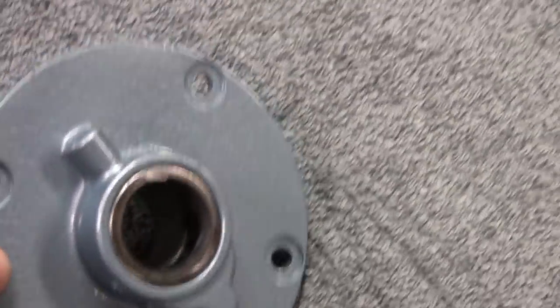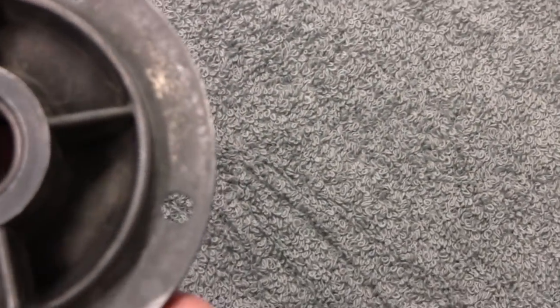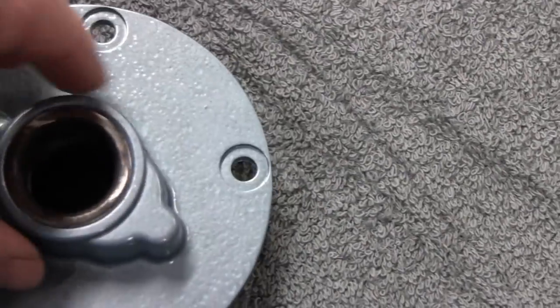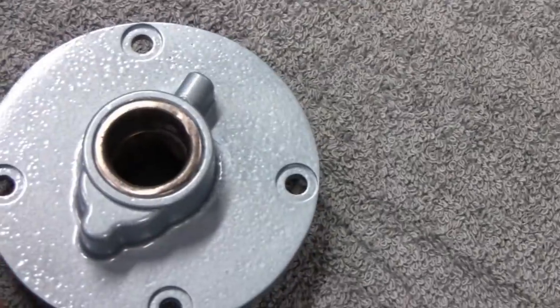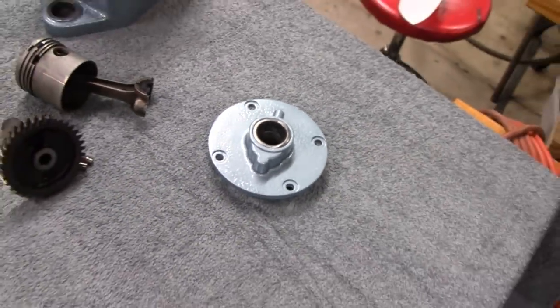You know, when I made this, a lot of guys left comments. I wouldn't say a lot, maybe about 4 or 5. Said I should have put it in the lathe, but I don't see any way of putting it in the lathe. There's really nothing good enough to bite onto. Everything is in the way here. Nah, there's not enough meat to bite in there, and this here is not round. I would have had to get a piece of 7/8 stock and then cut some threads on it so you can clamp it in there and spin it on that. But it's just so much easier to do that, and it did the job, and it's as round as it's going to get. So that's why that didn't go on the lathe.